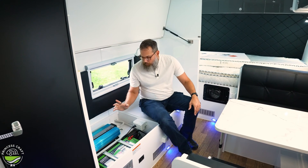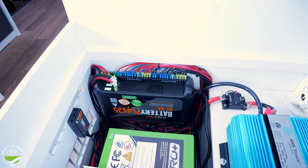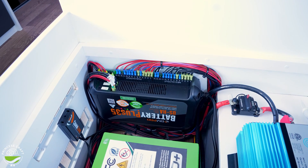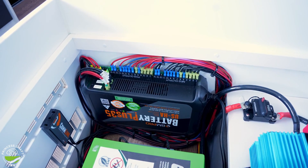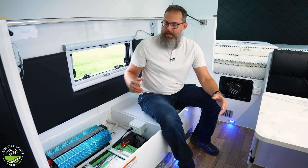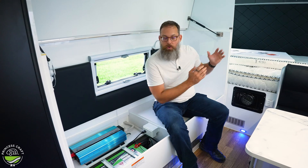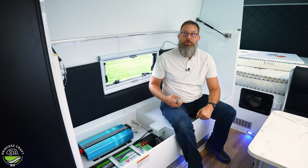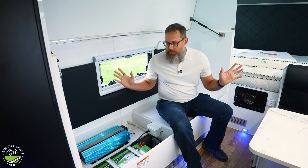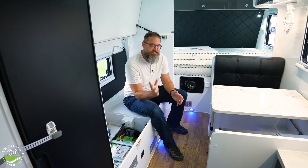The BM Pro Battery Plus 35 unit — specifically the Battery Plus 35 2HA or High Amp unit — is a really spectacular unit. What it does is what we'd think a traditional RV converter would do: it handles all the power going in from shore power, your tow vehicle, a DC-to-DC charger, or solar. All those power sources go into the Battery Plus 35, and then it smartly manages how it outputs across all the devices and outlets on your trailer.